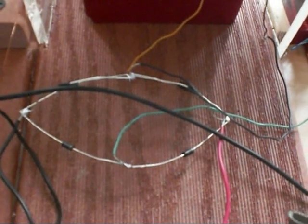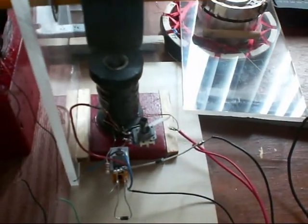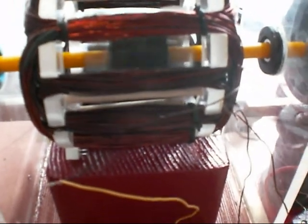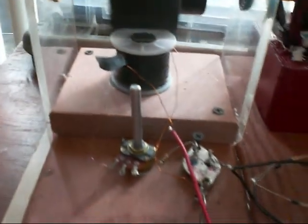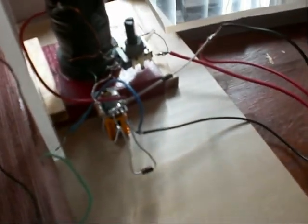Maybe you can give me some idea on why it's not putting out enough power. I'd like to figure out some way to get a little more power. Maybe I'll put bigger magnets in there, or maybe I'll just have to get some smaller wire. This is about 20 or 21 gauge wire. The coils are — this one's 26 and this one's 30. These are both 26 on this one here — the trigger and the run.